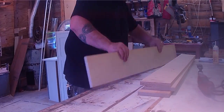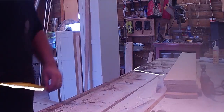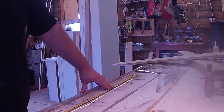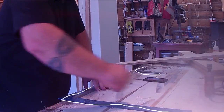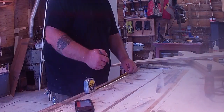I've got some pieces cut out to the right width and now I'm going to lay out the length I want for the glass. I'm laying it out on the work table — it's just a lot easier to use my work table for layout. I can do my math right here, get my center line, get each end referenced off one end of the table, and that allows me to get the angles I'm looking for.